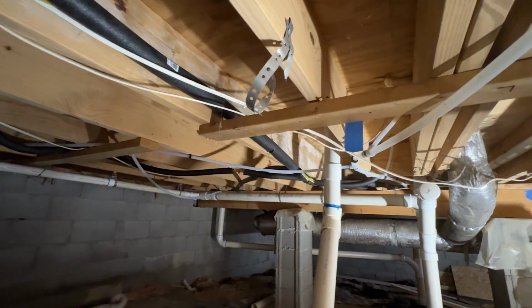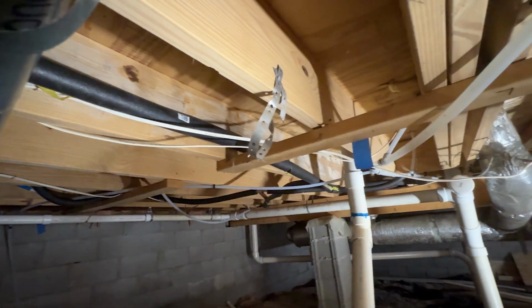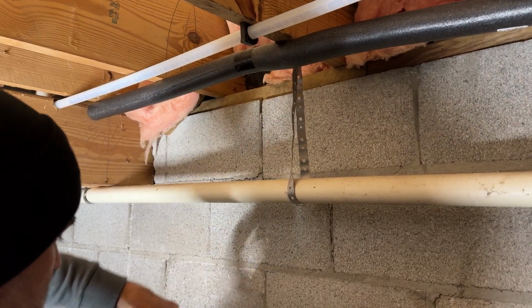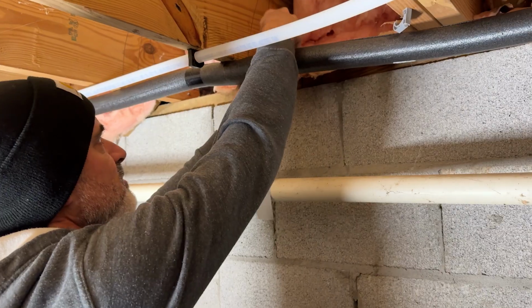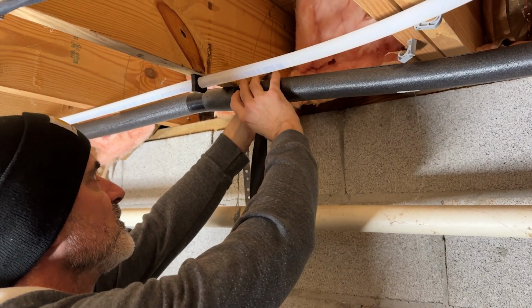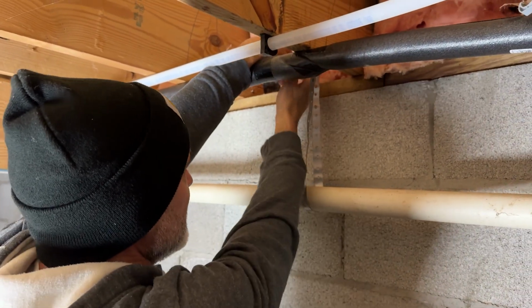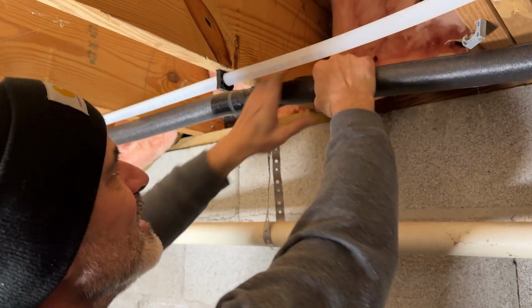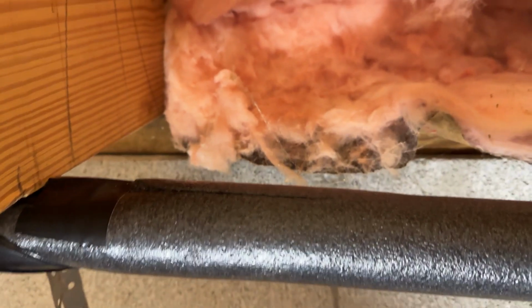So Zach is finished from that end. We met each other, and we just need to pull the yellow strips off those right there, make those seals, and then we'll get to taping. On places like this where we come in contact with a joist underneath and we got a little hanger there, all you really want to do is keep it from separating. So get it close, pull it till you feel it connect, run it over to the other side. Doesn't have to be super pretty. And then we make that seal. And you can tell there's a little bit up here too. We might run another little bead around that just to seal that little joint up right there.